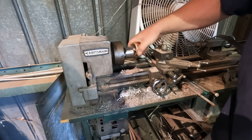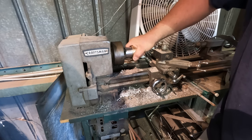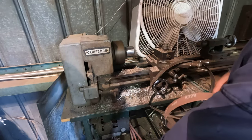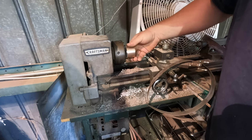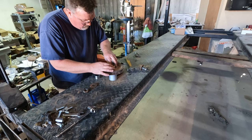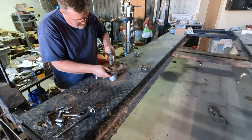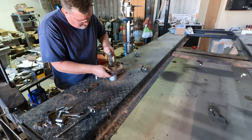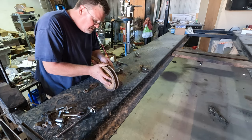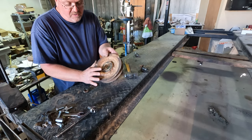Let's see how we're doing. It's kind of there — I might have to bore out this bushing too. I don't know what the actual size is supposed to be, but we're pretty close. I'm going to polish out this groove. Fits right over — that will work. I just popped this out of the freezer, and it's a slip fit now almost. It was a pretty tight fit before I put it in the freezer, so that'll be good. I want to make sure a little bit of bushing sticks out on either side so I don't run on the steel.